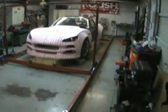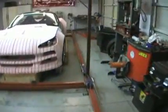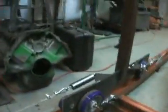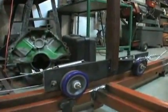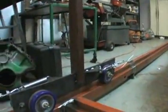The real important stuff is down at the bottom of the gantry, the braces. Basically, there are these little pulleys at each end, and they are pretty strong and pretty tight. And it goes along to another pulley, which then goes along to the wheel system. There's this track that we have big wheels riding on the inside, and then little wheels on the outside, which kind of self-centers and self-aligns itself.